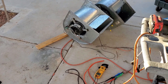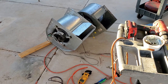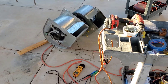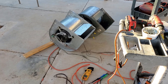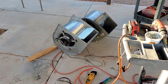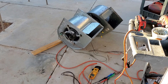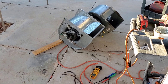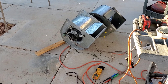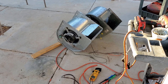It'll run no problem when the sun is up. With an ECM in my air handler — which I probably need to do if I ever run my compressor a little slower — maybe I'd send the DC up there from the solar panels. Not really something I'd probably bother with, just because that's a lot of work, and the ECM isn't going to pull too much power off my on-grid supply. But it's just an idea — an idea for anybody who ever wants to run something like that totally off-grid off a high-voltage solar array.